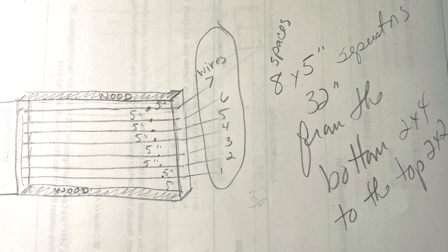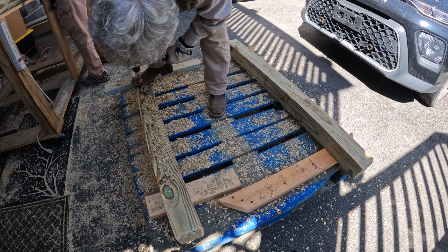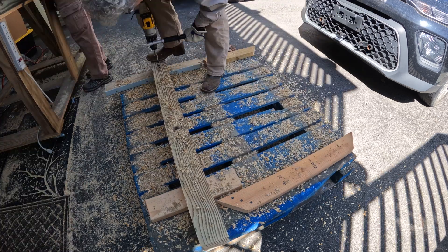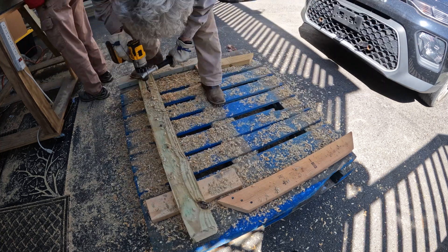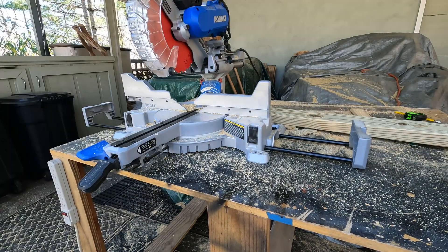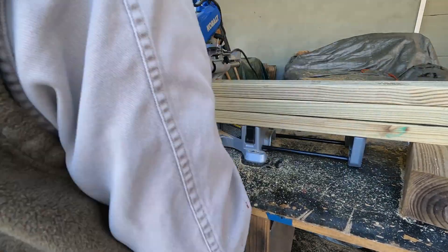So that was the end of part one, where they laid down the new decking on the bridge. Part two is going to go into the details of how we made the railings. I cut all of the 4x4 posts in half into 4-foot sections, chamfered the tops, and drilled six or seven holes spaced about five or six inches apart. Then we ran cable through them. We'll go into the details on the next video, part two. Please subscribe and like. Please join me watching this series. We're strengthening the bridge from 8,000 pounds to 60,000 pounds — that's a huge increase. The railing part is up next. Thanks for watching.